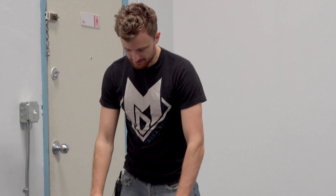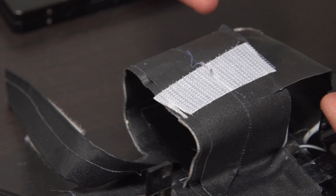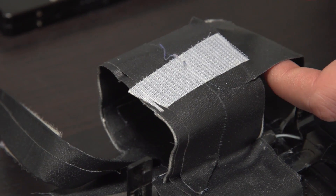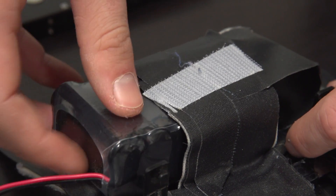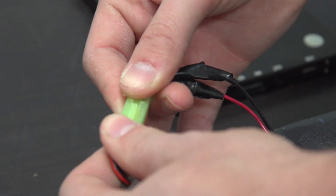You'll need your Lilliput monitor and the rigging to go around it — you'll have to experiment with it. You don't even need a rig at all, but you do need the Lilliput monitor. On that monitor you need a way to attach the battery for the monitor and the battery for the receiver. What I've built is a little rig that the big battery clips into, and a little pouch made out of gaff tape with a velcro flap that the other battery fits into. I've used airsoft connectors wired into the battery and to the monitor — I simply plug them together and that powers the monitor.